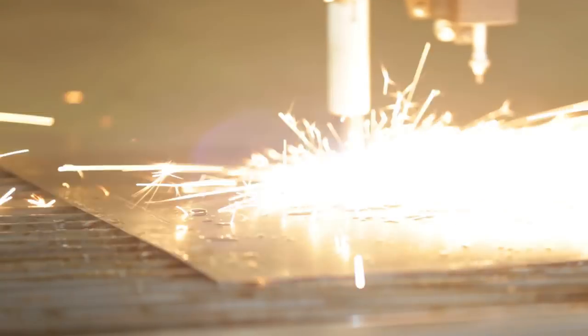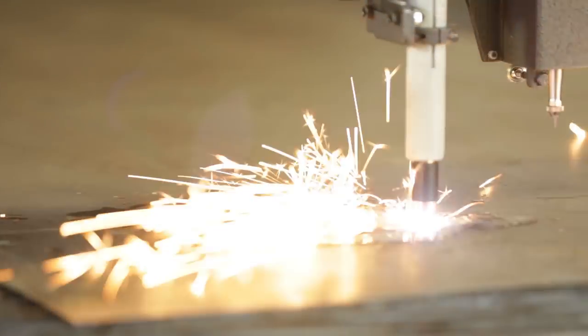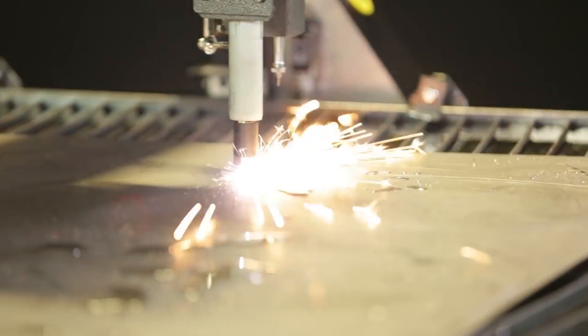So if I was going to do my best job on a piece of 16 gauge steel, I would use the fine cut consumables. They're the lowest powered consumables, so matching the power level to the thickness of the material is very important if you're shooting for the best cut quality.